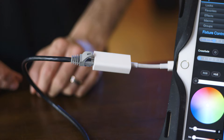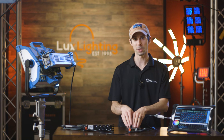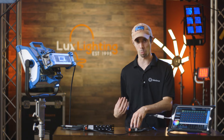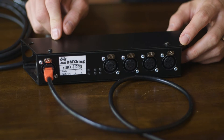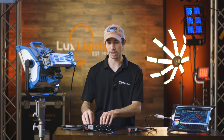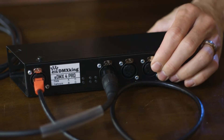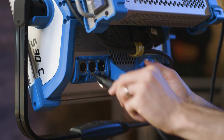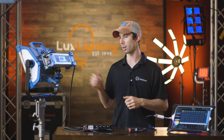So we have our iPad connected with an Ethernet dongle and Ethernet to our PoE switch, which is powered by the wall, and is now sending data as well as power to our PoE gateway. From here, it's as simple as connecting your DMX cables to your lights. And now you have Blackout talking with your lights.